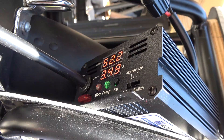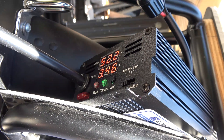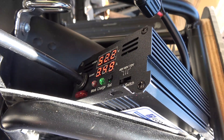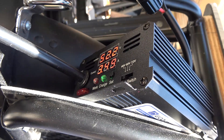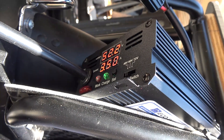The reason we're running at 3.5 amps instead of 6 amps is because the voltage has been boosted up to 52 volts instead of 32 volts under load. Therefore the current is lower, but the total wattage stays the same at 184 watts.